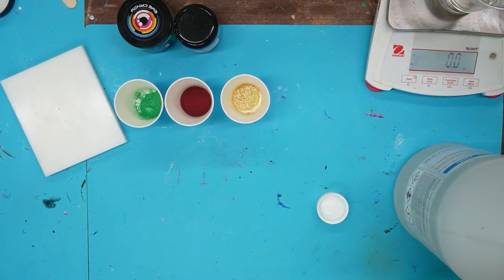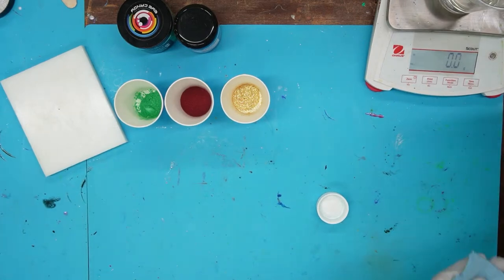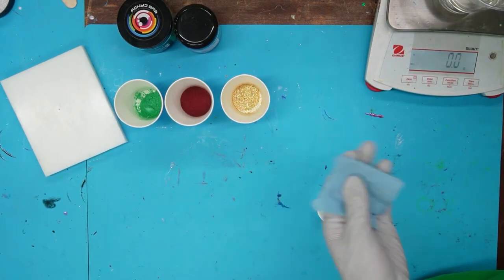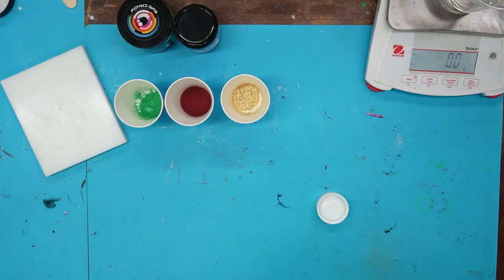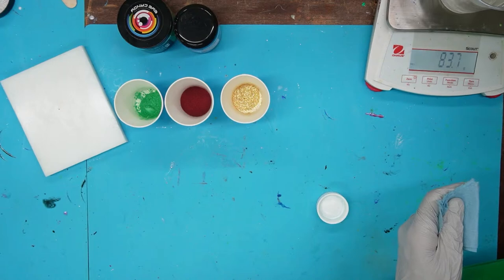I usually don't have to really deal with humidity here. We have pretty similar, maybe a little bit higher humidity than Vegas, but not much. I have seen a few times where there was a little bit of surface moisture on something, even in my shop. I can pretty much leave stuff out, there's maybe 15% humidity. I have a hygrometer, and I think it says 13% right now. So I don't really have to worry about that, but moisture can still cause an issue and it can cause bonding issues too.